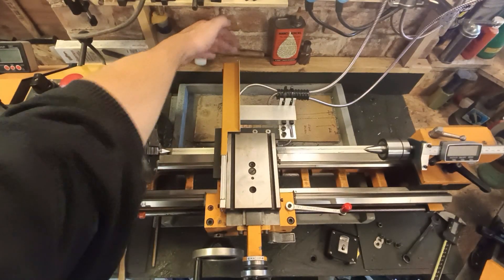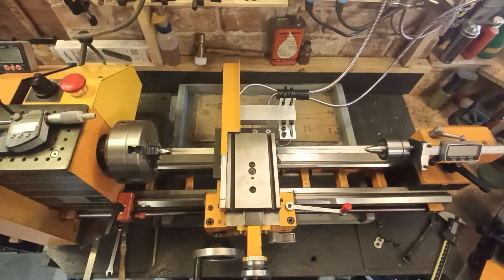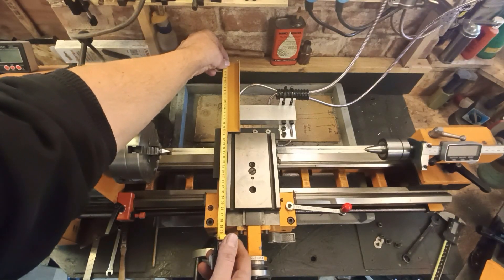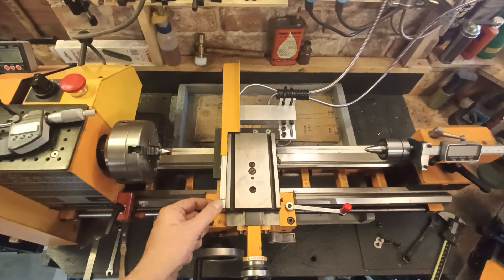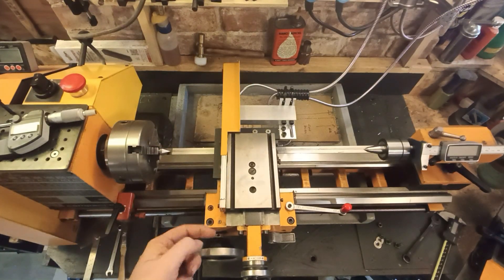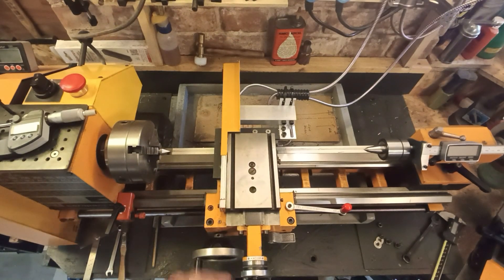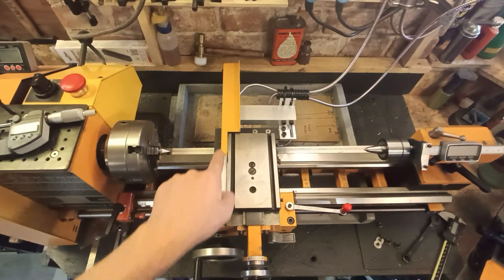This magnetic scale was a little bit longer, and I shortened it because there's a wall here and I didn't want it too long. I believe this scale is now 360mm — I originally bought a 400mm one. You can remove the end caps and saw it down to the length you need. I drilled two holes in the magnetic scale and attached it to the cross slide. The whole assembly lies on an angle iron, which you can see down here.